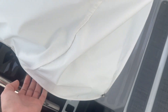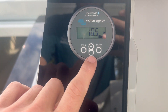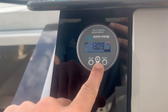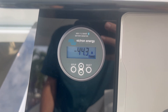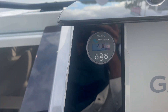If we come to the helm here, it's showing 10 hours of runtime down to 15% discharge — so we're using 85% of the battery. With the unit running at full speed, consumption is 44.3 amps. This is the consumption we're getting through the batteries right now.